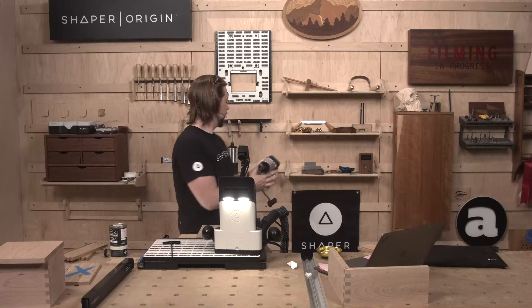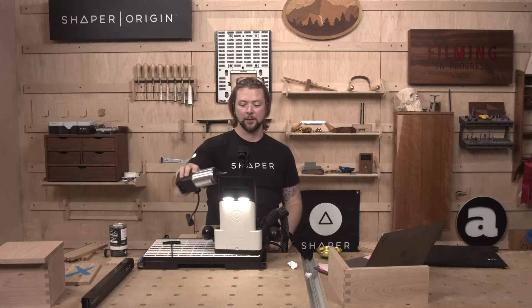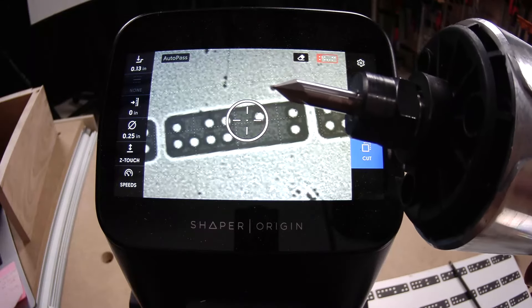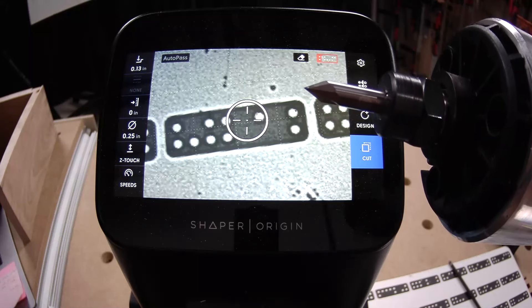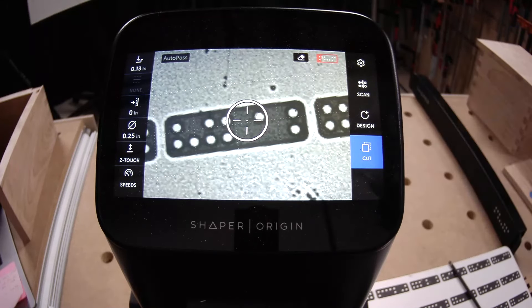Back to the engraving bit. This time, you might have noticed — I have the engraving bit in the proper way instead of backwards, because we're going to be doing a centerline grid where we actually make a mark and line our grid up using the point of this engraving bit like a stylus. We're going to center it on this lid.